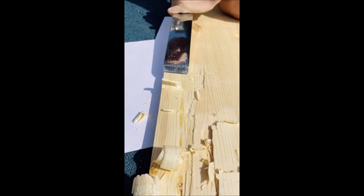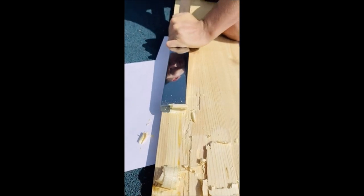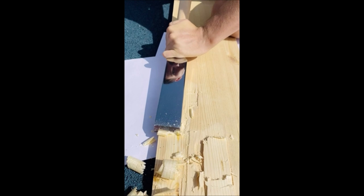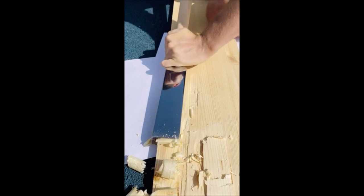The large handle gives you the ability to comfortably and securely hold the chisel with both hands and apply all your weight, speeding up wood removal and facilitating corresponding works. The long chisel length allows extremely fine adjustment of the angle of attack of the cutting edge, and therefore the depth of wood removal. You can cut wide, thin shavings, and the chisel will not get stuck in the piece of wood. The heavy enough weight also adds control over the tool and the ability to cut bumps with acceleration, almost like with an axe.